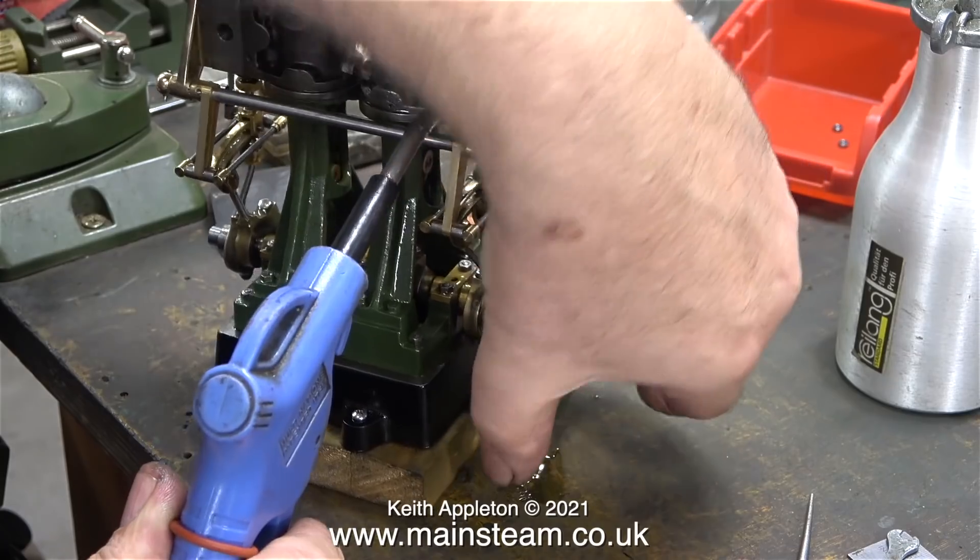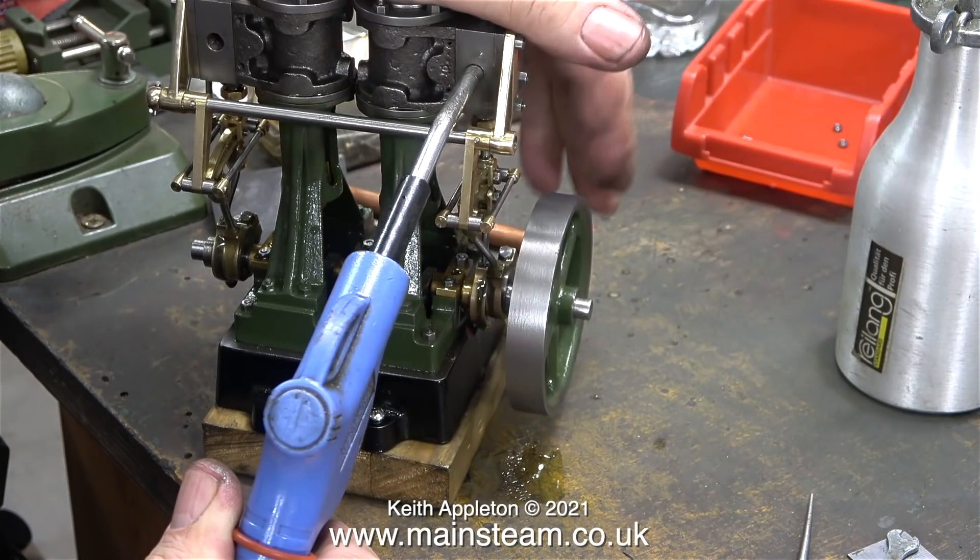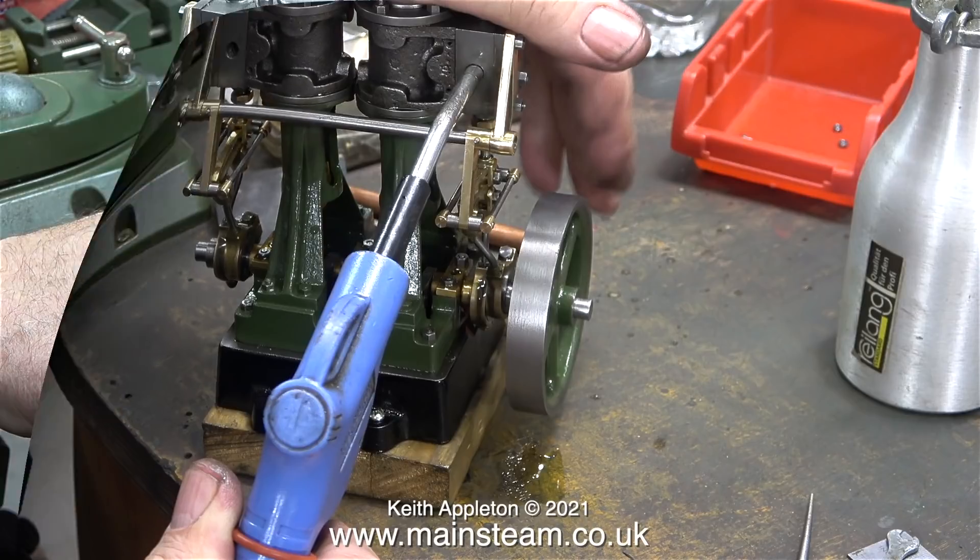The reason for this is I have not set the valve timing at all. The eccentrics are roughly in the right position but the valve in the steam chest isn't. The next episode will not be part of this series — as I mentioned earlier it will be called 'How to set up the reversing gear of a Stuart Models Double 10V so that it runs in both directions.' And that's it for this episode. I'll leave the steam engine running till the end of the video — stay healthy, thanks for watching, and I hope you found it useful.